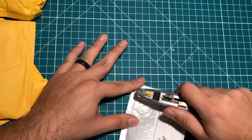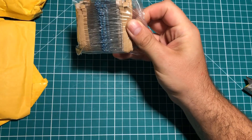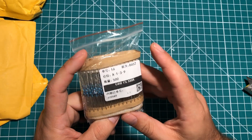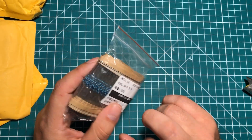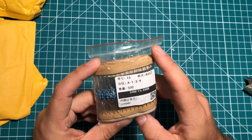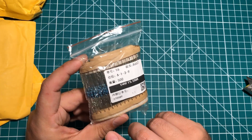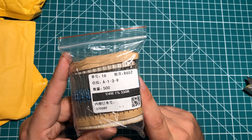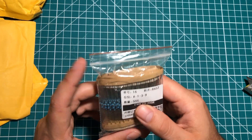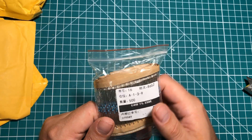Let's grab another one. This should all be kind of small tinkery things. We've got some resistors, and these are 330 ohm. I was basically out of 330 ohm resistors, especially the quarter watt ones. I just tend to like working with the quarter watt ones for standard breadboard use — the thinner wires on sixth or eighth watt ones don't make as good a connection. I got 500 of these for like two bucks, so here's another 500 to get me going.